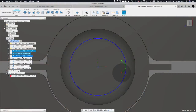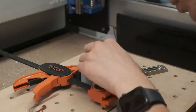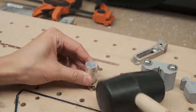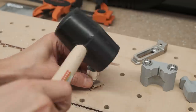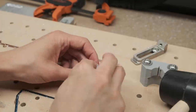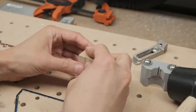I did have another idea I wanted to try for myself: embedding a magnet in the trunk. I had some half-inch diameter disc magnets I figured would do the trick, so I created a shallow pocket toolpath with many variations of stock-to-leave, letting me creep up on the perfect fit one thou at a time. I bored out progressively larger holes by adding negative stock-to-leave until I could almost fit the magnet. I could have gone oversized and used CA glue or epoxy, but I felt an interference fit would be just as permanent and require no cleanup — a tight bore would have caused a lot of squeeze-out with an adhesive. With the nose of my dragon cushioned and seated in a hole on my CNC table, a couple of taps with a mallet permanently locked in the magnets. This isn't a variation I plan on selling because it requires a lot of trial and error, but it's one I find extremely satisfying.